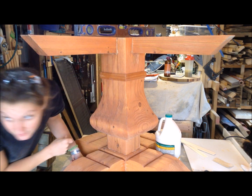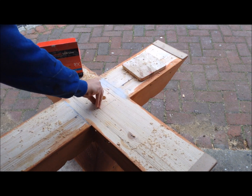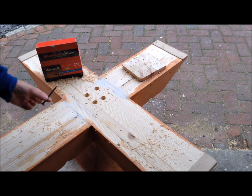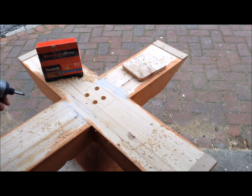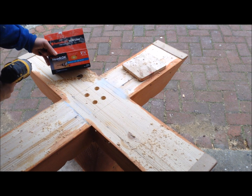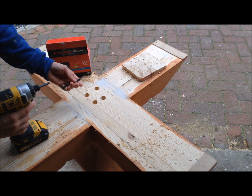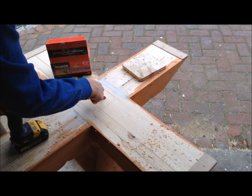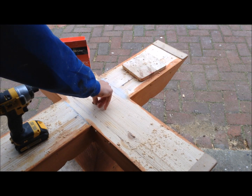Before I head in I'm going to add the quarter round to the base. This has dried overnight, and the last thing I have to do to this base before it can finally be painted is sink some lag screws through the bottom into the pedestal, just as added reinforcement. I had these left over from another job — they're two and seven-eighths inches, and with two inches left in the lap joint, I counterbored some three-quarter inch holes about an inch down using a spade bit, so the screw should go about an inch and seven-eighths into my pedestal.